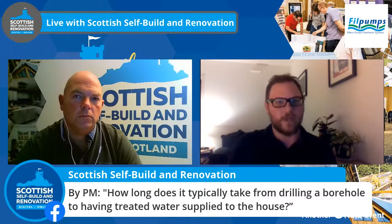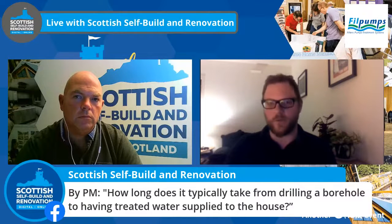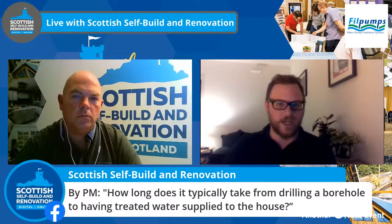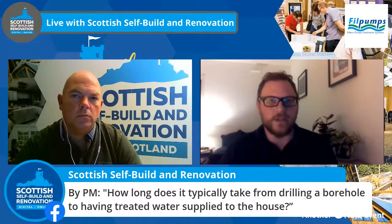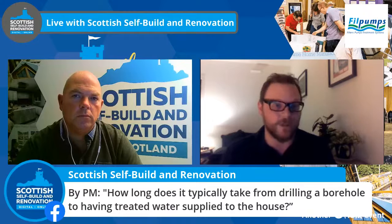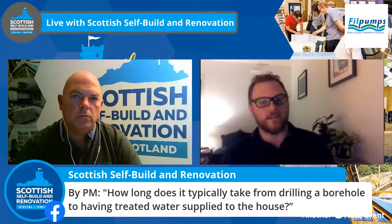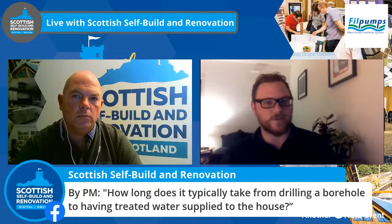Whereas, touching back on the presentation and the problems with wells and springs, if we were to use well water test results from a year ago, we wouldn't be comfortable because there's no guarantee that in the year since the quality hasn't changed. So you can take that breather, and come back and install a treatment system at a later point, which is handy for a new build, giving the house a chance to be built to the stage where there's electricity and there's space for us to install everything.